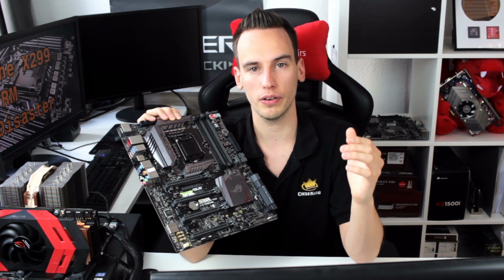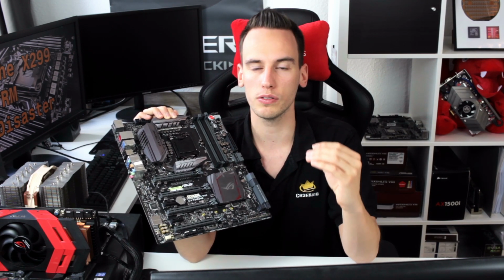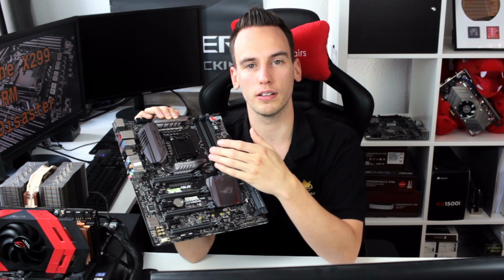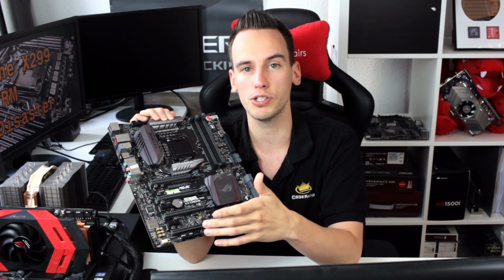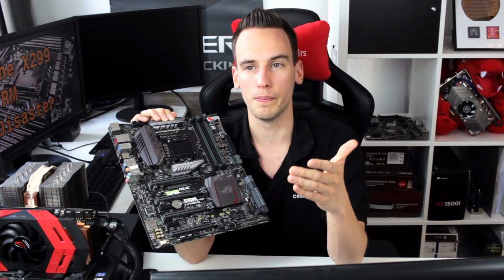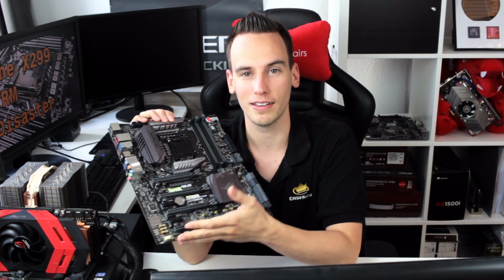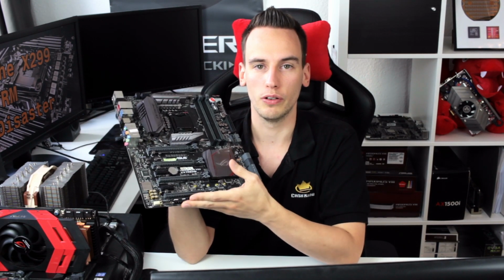The thing I would like to point out is that if you're a vendor, and for sure I know that the vendors are watching this video, just go back to some proper heatsink designs that are working well, so that we have more headroom, because all of us consumers really like to have our components cold. We don't want the components running at 100 degrees if we're overclocking, even though we know that 105 would be the limit. We don't want it to be at 100, because we know the higher we go in temperature, the lower the lifespan is. So what we want is a combined design, but still a very good heatsink. And I'm sure that you can even turn this into your marketing and make some new cool USPs out of having a very nice heatsink. So I really hope that we will see some very, very good heatsink designs in the future, and not only design-based stuff.